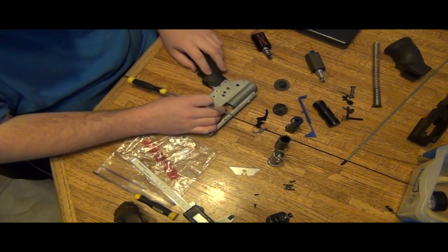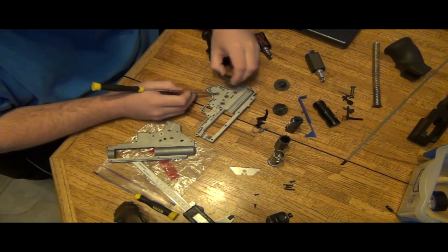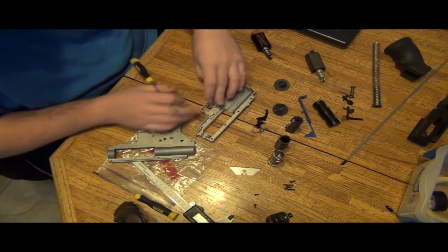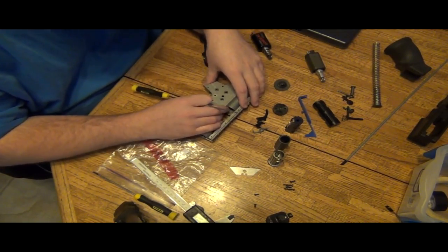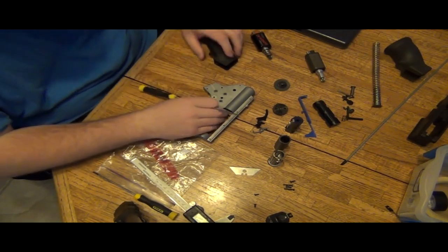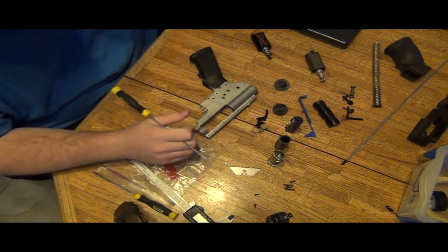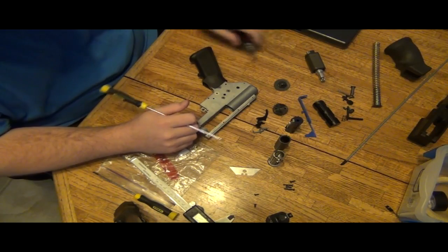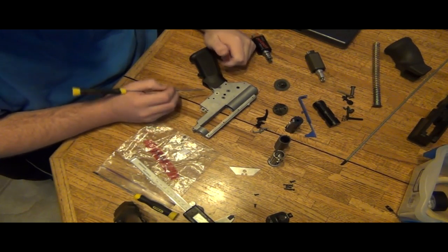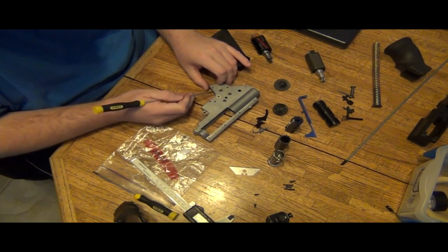So you would take this all apart, open this up, and you would take another 0.1 millimeter from the bottom here and add it to the top. A friend of mine likes to call that flip-flopping. Kind of makes sense because you're flopping your shims over back and forth. So we'd have your pistol grip here, and when we go to check this, there would be just a little bit of movement here. Now you could keep adding until it gets too tight where you can't fill it.